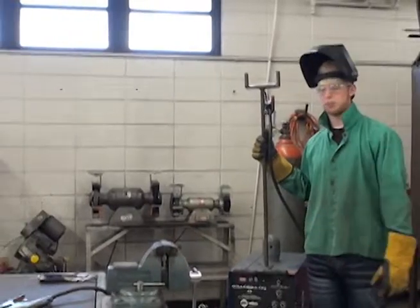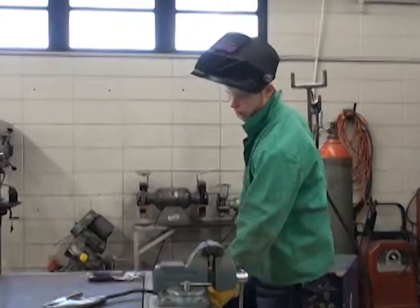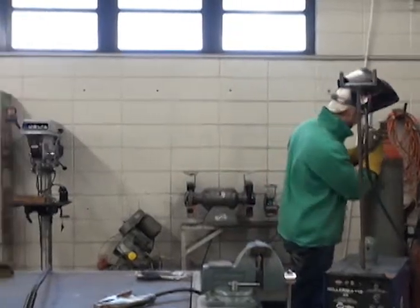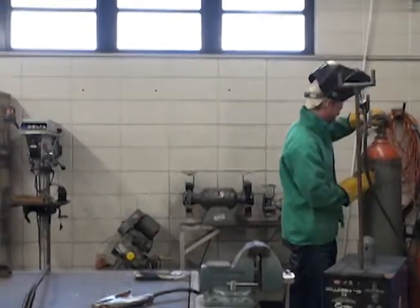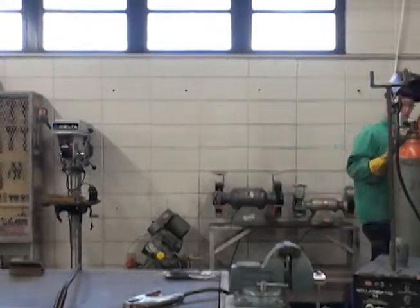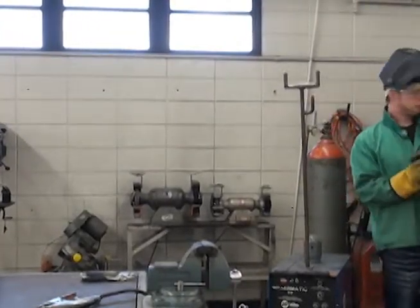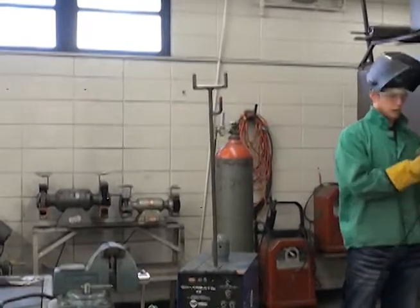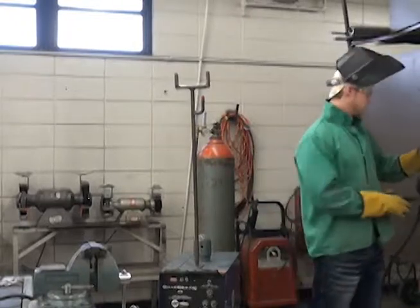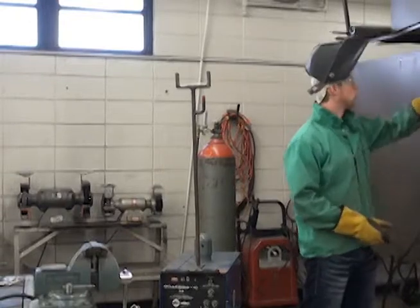This is what we're going to use to operate the welder. First thing you need to do is check your leads for abrasions or anything that might be a problem. You need to come over here and check your gas — make sure it's got pressure on it and make sure the dial is all the way up. Listen to see if you can hear any kind of leaks coming out of the gas tank. Next, grab the plug and plug it in over here. Make sure it's in good and secure, and make sure it's free of debris or anything that could obstruct the cord while you're welding.